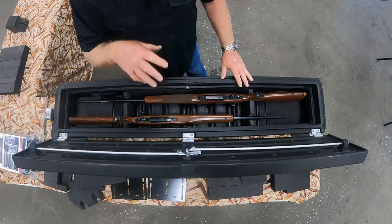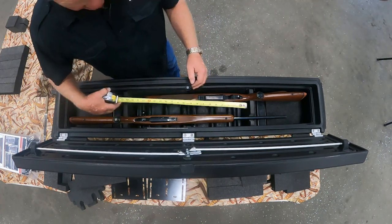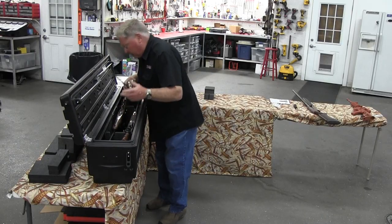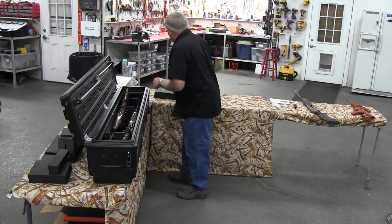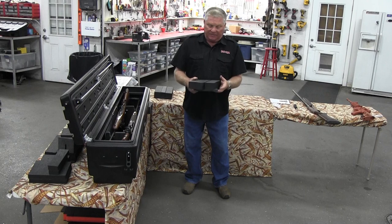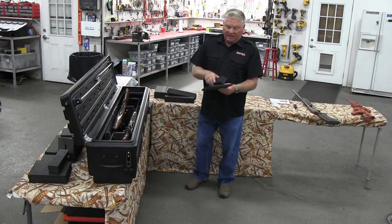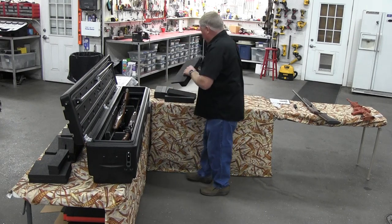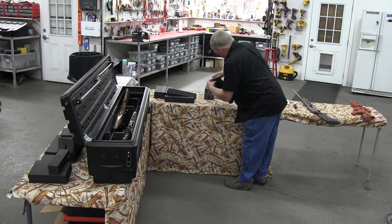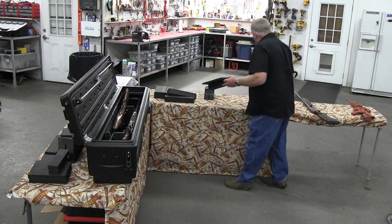I drop the second gun in the same way with scopes laying down. Now I take a tape measure and measure from the inside of the gun rack to the scope — ten and a half inches on one end, and one inch on the other. So I take the base piece: I have four pieces total — the floor and three pieces above. I take out the two outside pieces and put in the centerpiece, with pre-drilled holes. I just put a screw down and use my screwdriver to install it. The material is expandable polyethylene, which is very tough.